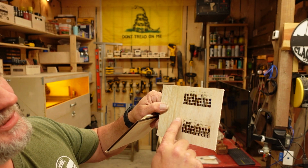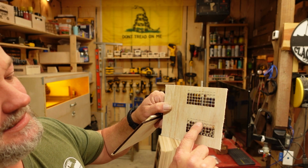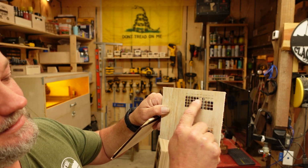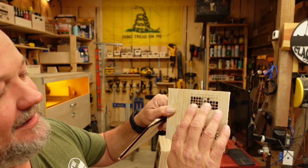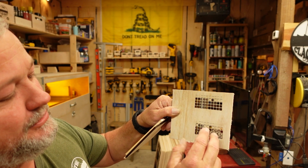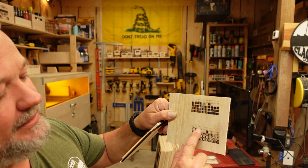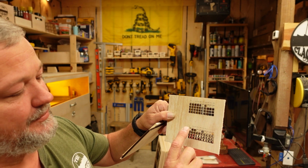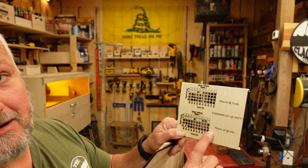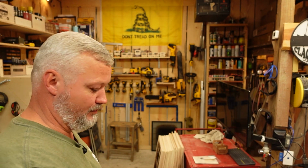On the back side, you can see it was still penetrating even at the higher speeds, but it's kind of hit and miss. So keep into consideration that this wood, like I said, even though the grain runs this way, gives me a good way of trying to get as close as I can, but there still could be some glue variations and stuff on the bottom. But shop air at 10 PSI, or factory air, either way, this machine is very capable of cutting the 4.5 millimeter Luan.